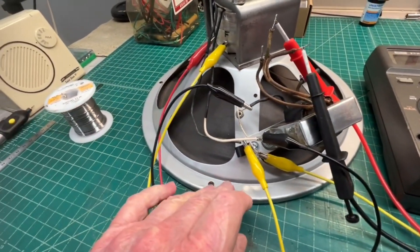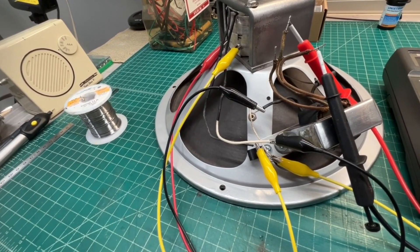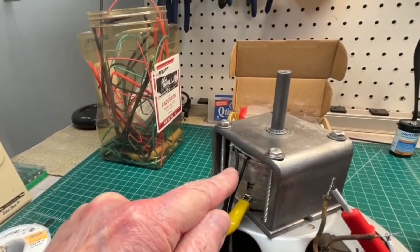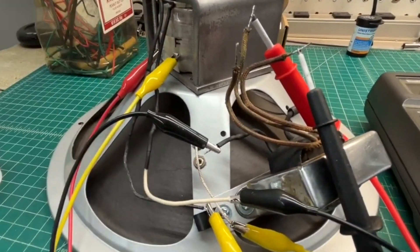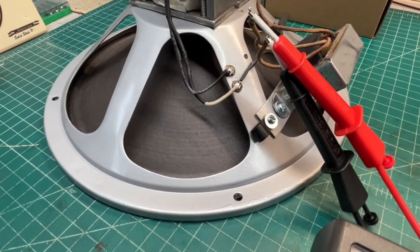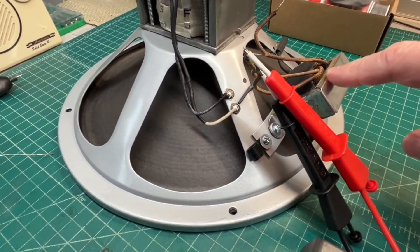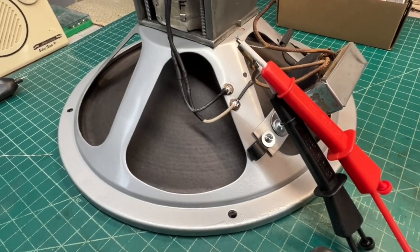Let me get this tied in now, since I know the correct orientation. The polarity being out of phase between the humbucking coil — which resides here — and the voice coil. I have the configuration of the humbucking coil correct. And now I just want to look at the output transformer again, being a center tap, because this is a push-pull configuration receiver.